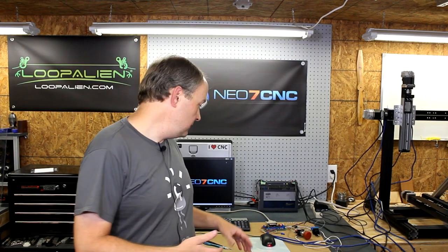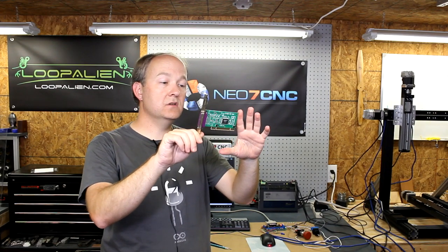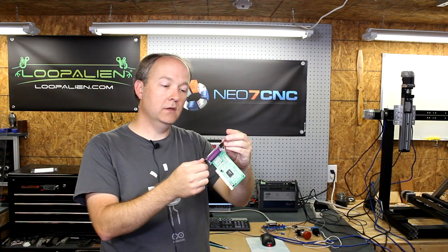What you'll run into today is having a hard time finding a machine with a parallel port. You can buy add-on parallel port cards — this one happens to be a StarTech, and I've used it on another machine where it worked correctly. Sometimes you have to worry about chip sets, but this one's always been a winner. The C10 board is less than $30, and even if you need to add a parallel port card to a PC, it's also relatively inexpensive — probably less than $20.